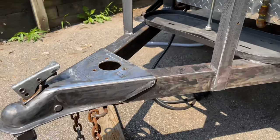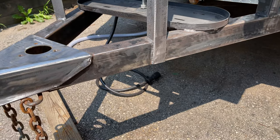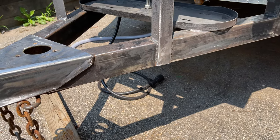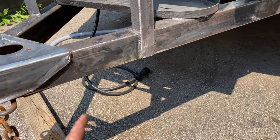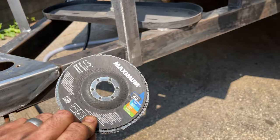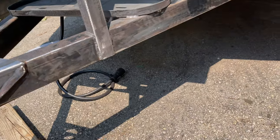What I just used is a wire wheel here. I like to use the knotted wire wheel because then the strands don't fly off into you — it just makes it a little better. And then for the flat surfaces, I just used one of these flapper discs. That's 40 grit — makes it nice and smooth.